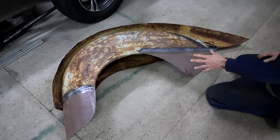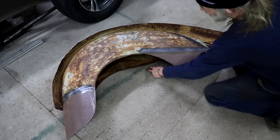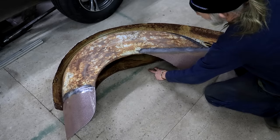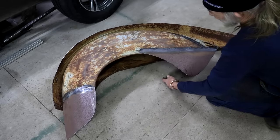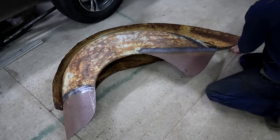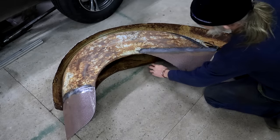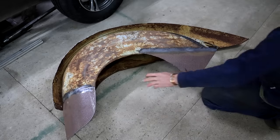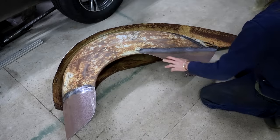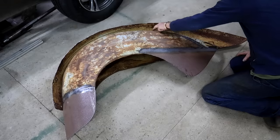So yeah, just comparing it to the original sister, which is the one in the bottom. Well, actually, that bottom one is not original. Somebody has changed it. The 1939 Hudson rear fender actually came like this and then it moved backwards. So at some stage in its life, somebody must have decided to change it and make that straight line. So I added this piece and I added in this. And then, of course, we move this line in by making a pie cut right there.